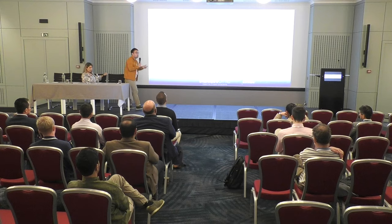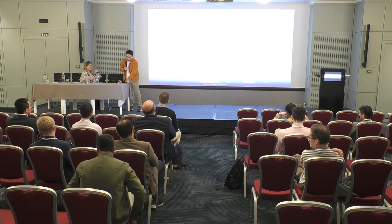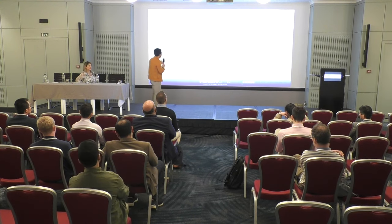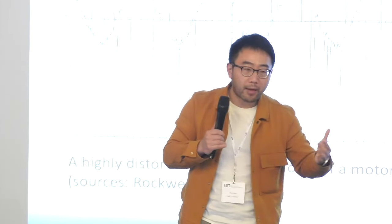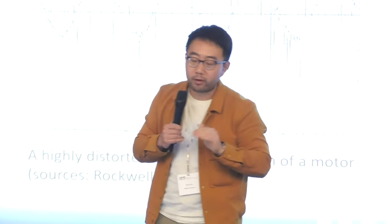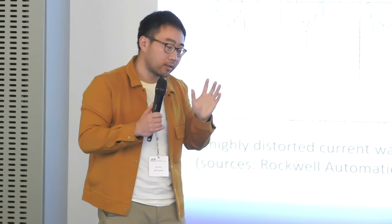So speaking of motor drives, I understand some people here are doing motor drive applications. Just this year, I worked on a few motor drive products. The previous case we showed you has two motor drives connected together, one doing motor drive and the other doing regen. If you're not doing the cable arrangement properly, as we explained, a 3 meter long cable, if you work out the math, often radiates in the 10 to 30 or 50 megahertz range. We normally start testing such products from 30 megahertz, so that's a problem.